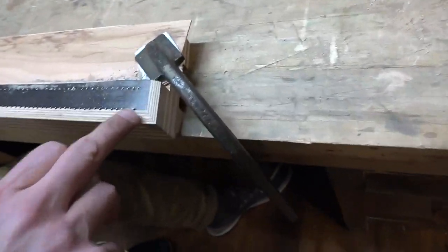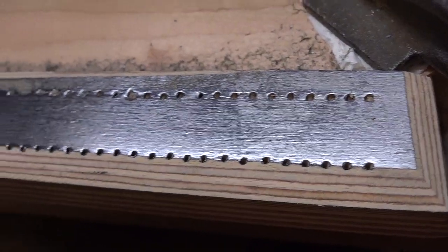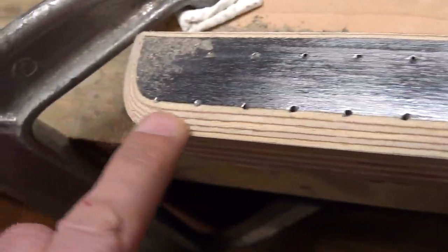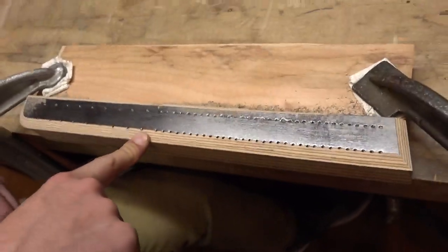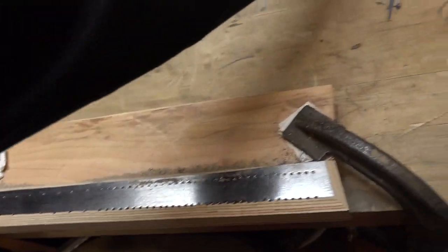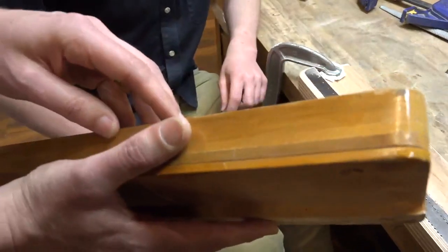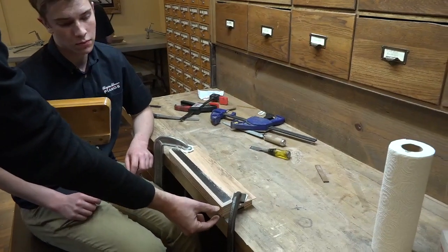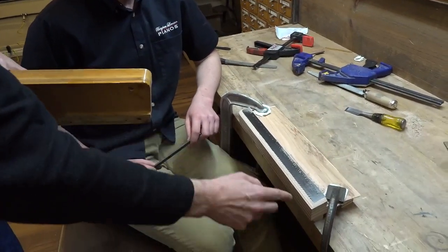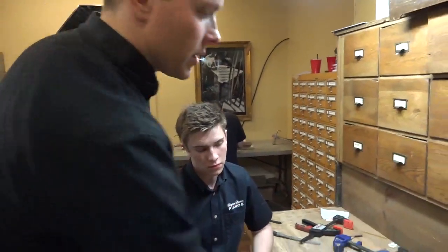This edge — it's almost like a CNC machine did it. It's just beautiful, beautiful craftsmanship. Same with this around here. And the other thing to note before we go check out the piano and how we got the height right: the material he's using is going to be way stronger, simply because it's so many more plies of that maple. What he has down here is the pin block, which is similar to this. That's all pin block material. And then from here up, that's the bridge capping material, which is even more plies and even harder than the pin block.